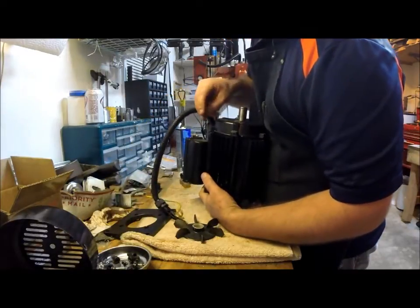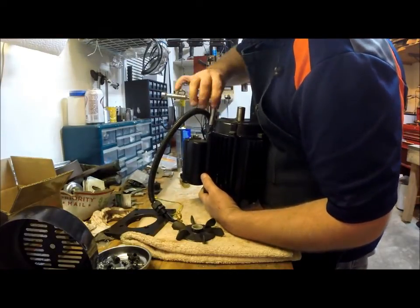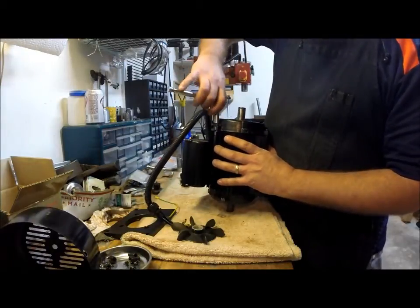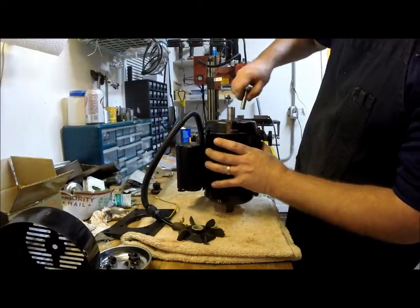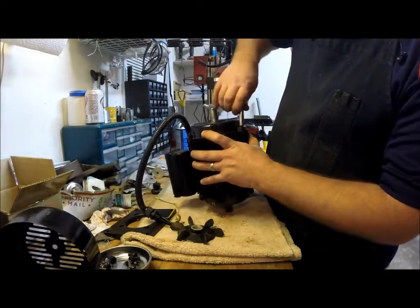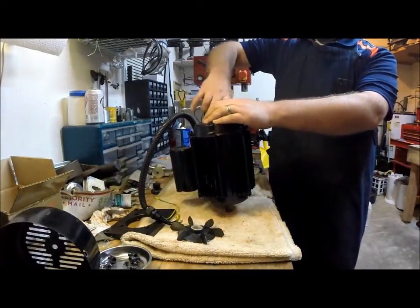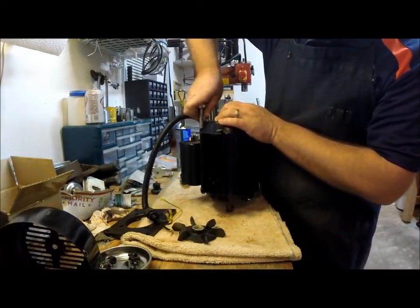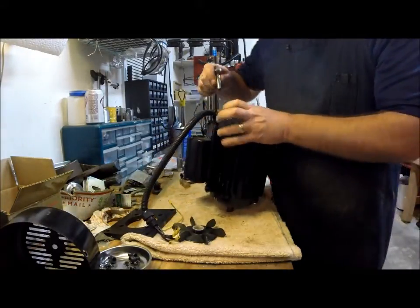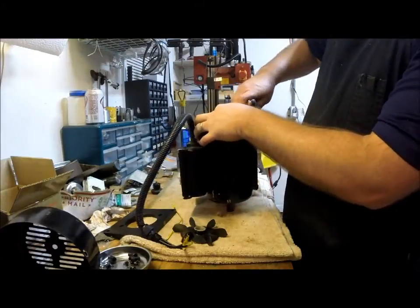Get a bolt. And just go in sequence so that everything gets tightened up nice and evenly, and that we don't pinch one side or the other as we tighten. Make sure that nothing binds. You can hear that bearing seating in the bottom housing as we tighten these bolts. That's what that pop-in noise is.